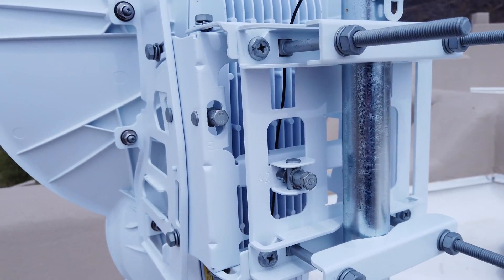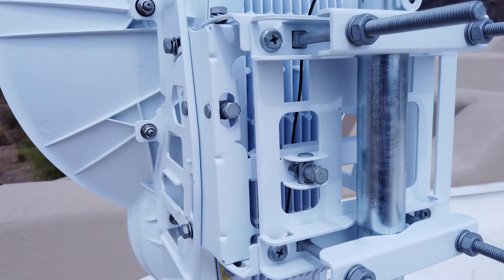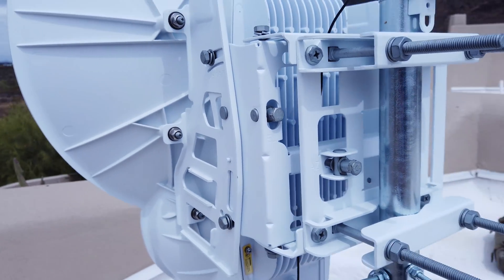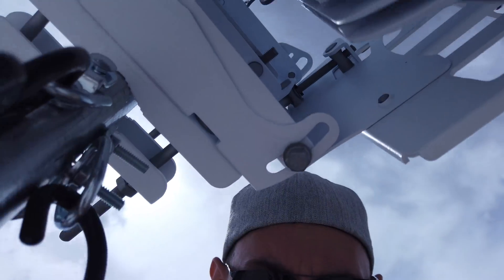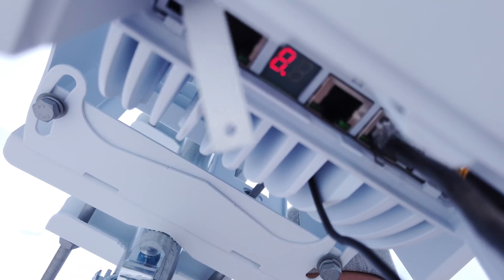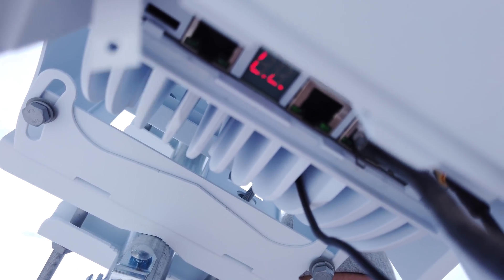It's ideal to have someone on the other end, but I don't have anyone over there today. So we're going to wing it and see what we can get done, because if you look in the little box thing down here, there is a little LED readout that tells you your reception. The lower the number, the better. And that's the basic gist of it. It takes with these big antennas, with a really, really narrow beam, a lot of patience. But the little nano beams — the ones I was using before — those are pretty easy. Like the one I had here before, we didn't even aim it; we just kind of pointed it that way and it connected. It was like that for a little over a year.